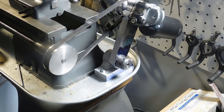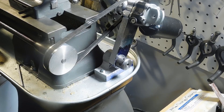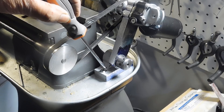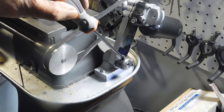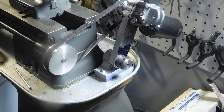Here's the arrangement I came up with. I put an extension on the lead screw and a pulley on there — turned two pulleys. This belt is the same belt I used for my surface grinder, so now I'll have a spare for each one. The motor is a 12-volt — it's the motor that moves the seats in your car, back and forth. Seventeen dollars and some odd cents. I used some half-inch aluminum and a one-by-three piece of aluminum for the base. There's a quarter-twenty carriage bolt through here, cold-rolled steel on the end, and it tightens with a jerry bar. We'll go upstairs and put the electronics together and come back down and see how it runs.